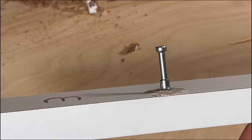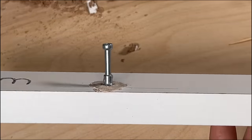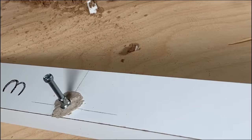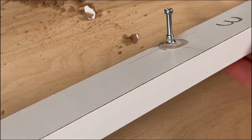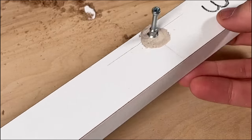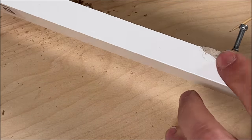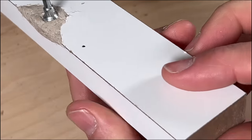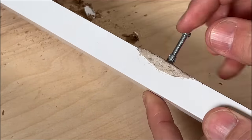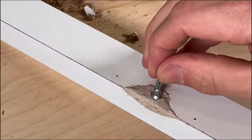Let that set up — there will be a little extra material to work off later. Press the Quick Wood back down to ensure it's securely held around the cam screw, and check both directions that you're happy with the cam screw orientation before it dries. After it's fully cured, use sandpaper or a Dremel tool to smooth out the surface, especially if another piece of wood will sit against it.